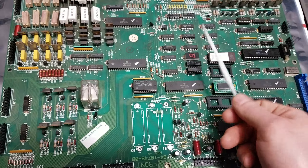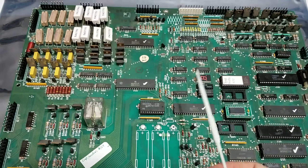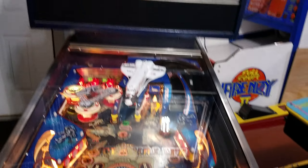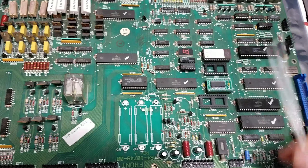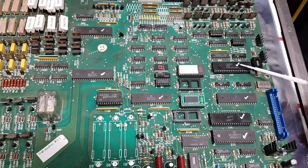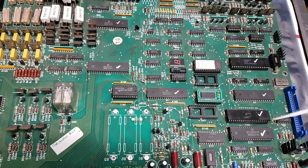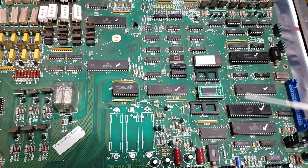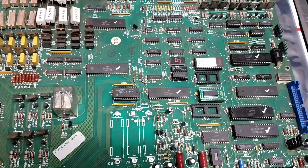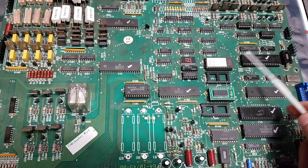I was still getting nothing on this board. I since got a Space Shuttle and a Sorcerer, so now that I have two System 9 games I was more cavalier about trying to fix one without messing up the other. One of the first things I did was swap my two processors into a working System 9 game, and I found out both processors on this board were bad — they locked up the MPU in the good game. I found spare processors and plugged them in, but I still didn't get anything. The ROMs that came with the board were discarded; I burned a new one and confirmed it was good in my Space Shuttle.